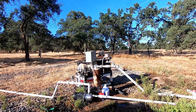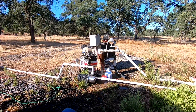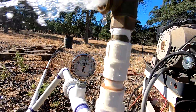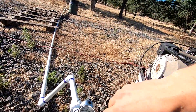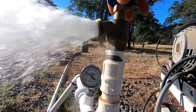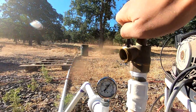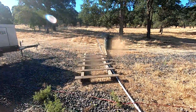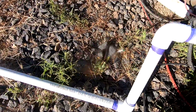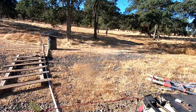One thing to be concerned about when you have an application with this much water going up a hill is water hammer — that can be extremely dangerous. I'll show you what I mean. I'm going to open this spigot and you'll watch 130 PSI on this gauge — now it goes down to about 30 PSI. As I close this, the pressure's going to build back up and go all the way up to 160 PSI briefly as it tries to get the momentum back into the water going up the hill. That's a big deal because if you have pipe that's not rated — now this pipe is rated for 450 PSI — but if you have pipe that isn't rated and you have all that water slamming up and down the hill, you have the ability to blow out a pipe. It also creates movement.